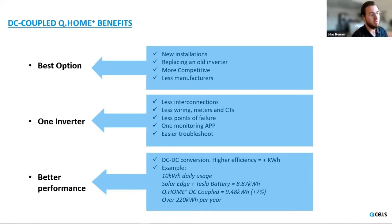A critical point is the efficiency boost from DC-DC charging. When you're doing DC-DC charging, the solar energy being generated isn't converted to AC and then back to DC to charge the battery — it stays DC-coupled, so you gain charging efficiency. As an example, you can gain about 7% increased charging efficiency with a DC-coupled solution. In a small example here, that's 220 kWh per year saved because of that efficiency. Over a 10-year product life, potentially megawatts of energy can be saved just because of that conversion efficiency.